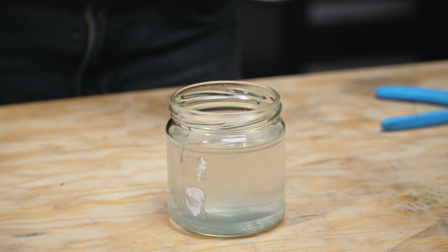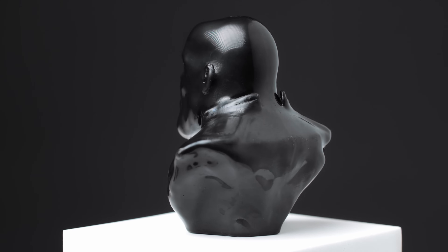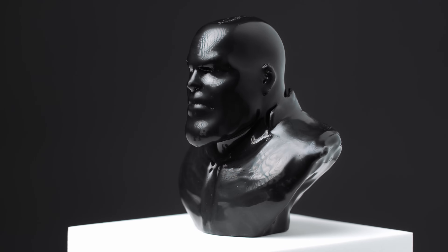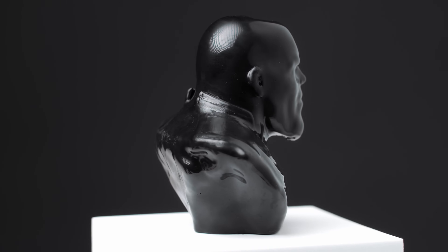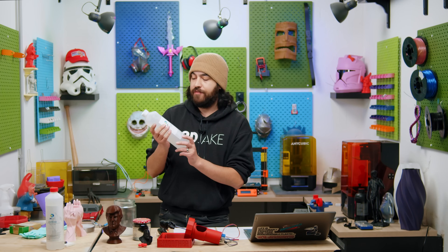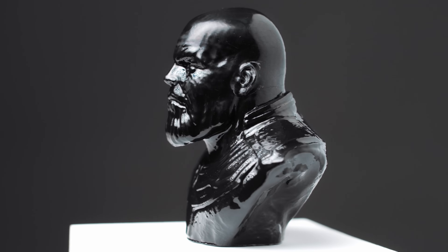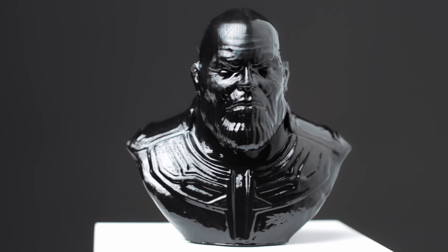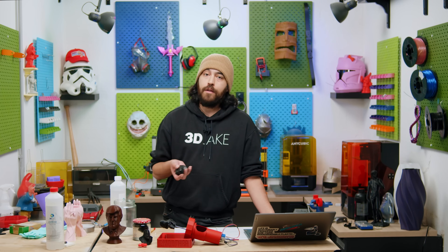There is one last method I want to share about acetone smoothing, and it's not really that well known. Beginners might think it's easier to just dip the model in a bath of acetone — this is generally not advised, and I'll show you why. You get a white coating, and you've over-smoothed because acetone has pooled and is bonding with the ABS and can't just be shaken off. But what if I said this isn't such a bad idea with one small adjustment? This is IPA, commonly used in resin printing for cleaning models. It barely reacts with ABS. But if you mix acetone and isopropanol and then dip your model in, leave it for a while — hey presto, no white coating and it's smoothed. Repeat if necessary to get the desired level of smoothing.